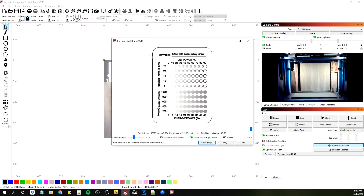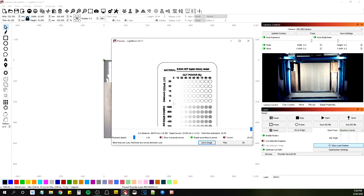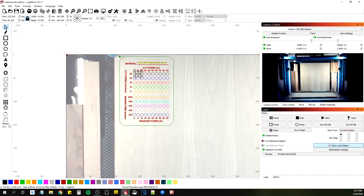I've already looked at this and if you look at it in the preview you can even see the power scale effect there because of the gradation. I think it looks pretty good. I'm gonna save it and send this to the machine — I'm gonna go with the current position with the job origin at top right. What that means is wherever you put your laser head's red dot, that box is representative of it, so from the position of here it's gonna frame my work right there.